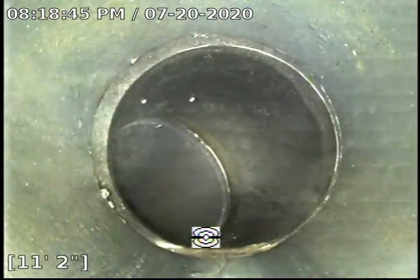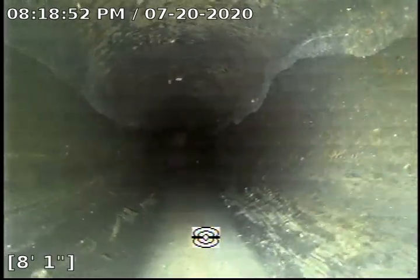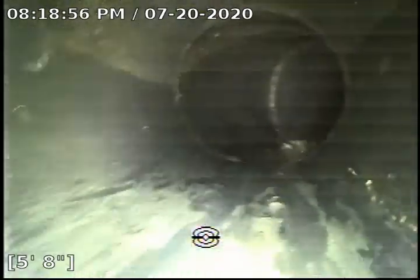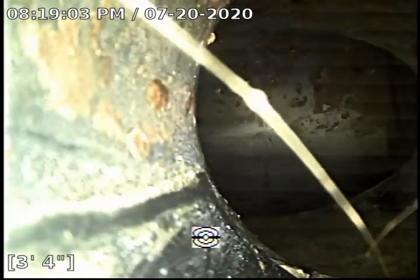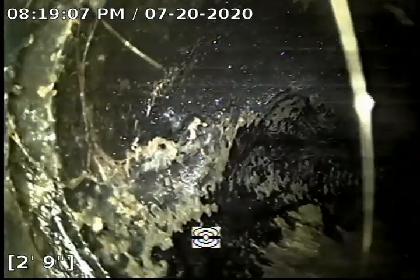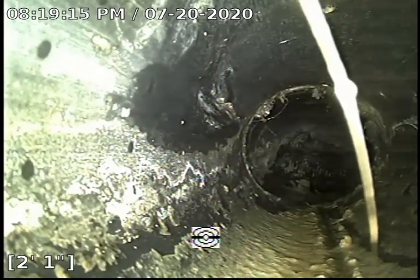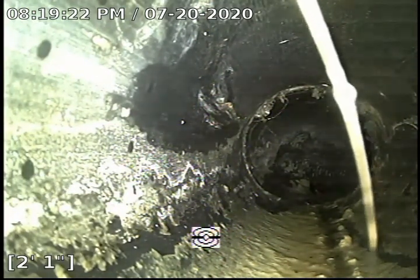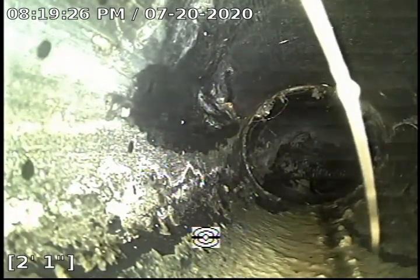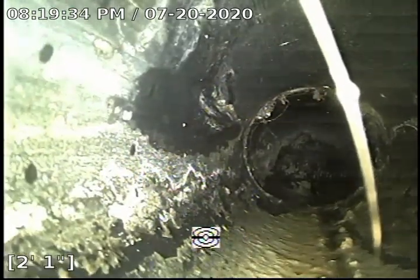As far as the drain pipe goes, we are going to do a little bit of correction after doing a quick inspection in the crawl space area. The section was puddling water right at the backflow device. All the drain pipes in the crawl space have been replaced with ABS plastic. Hydro-jetting this line would probably be ideal — mainly cleaning the spots between the backflow preventer area — just collecting some water. And then trying to strap the drain pipes properly to provide the proper slope so the water can drain correctly. This will conclude our sewer inspection.